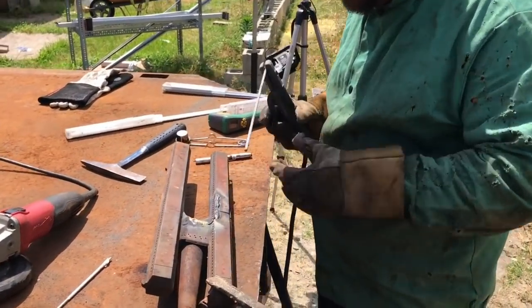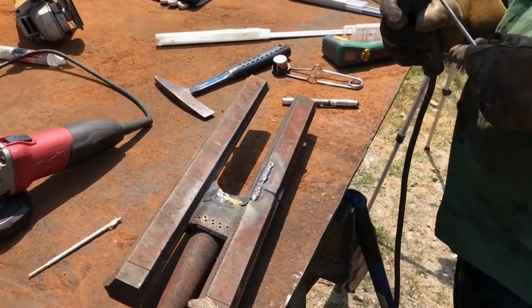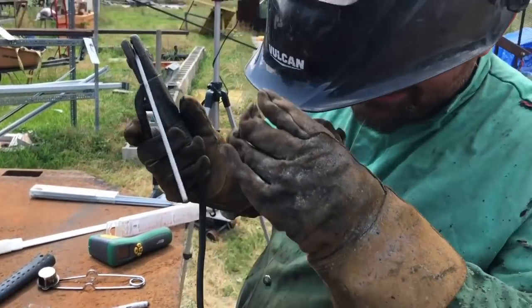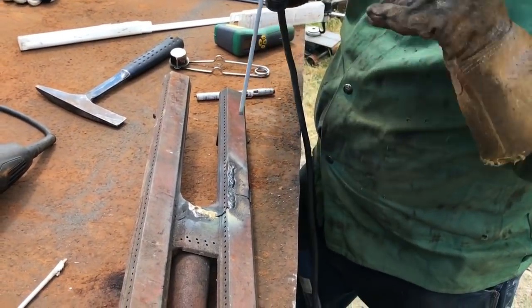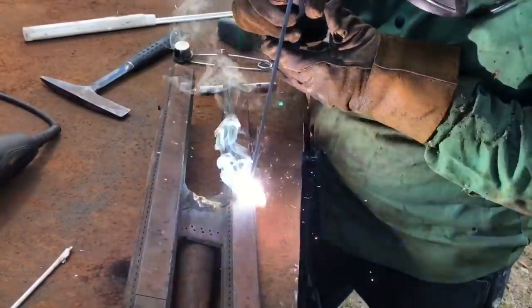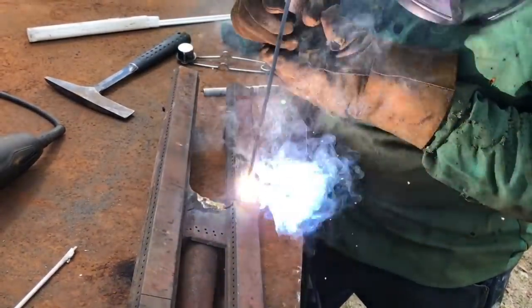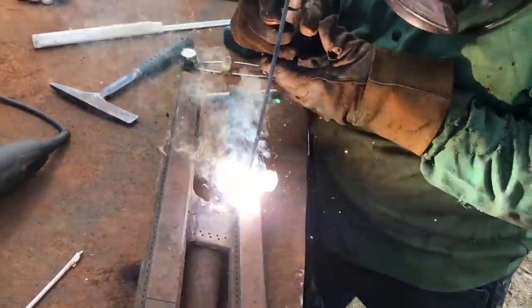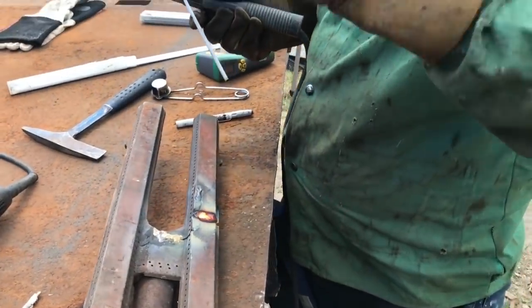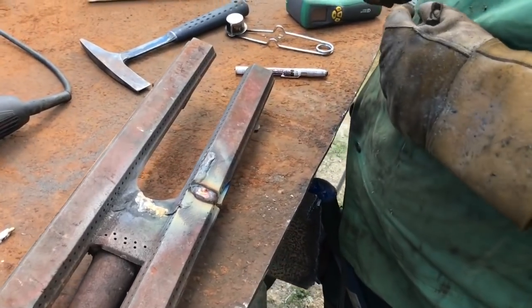It's got some nasty slag, I'll tell you what. Out of all the rods I've used, this one's scary. It's almost like a 6013 at times if you're not paying attention. Pretty smoky too. Oh, I bet. Not the worst, but...